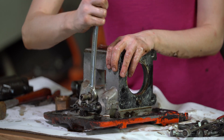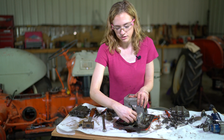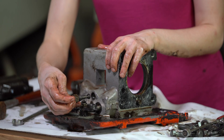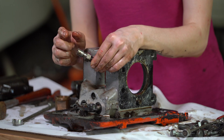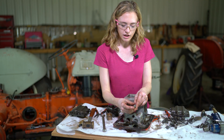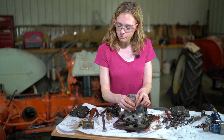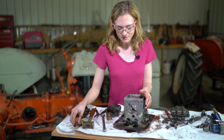I'm going to take this relief valve out of the bottom of the pump here. This takes an 11/16 inch wrench - it kind of screws in like a spark plug and it's got a spring on the back. Now we determined in the troubleshooting video that this relief valve was not damaged or broken.